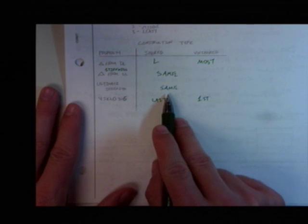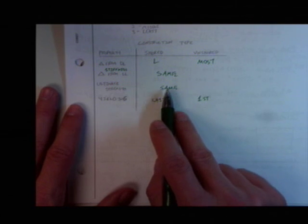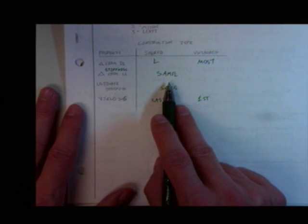Okay, just good to have all this in our heads, to understand what's going on. So if we're doing a design calc, does it make any difference if it's shored or unshored? No, it doesn't. At least for ultimate strength. How about for live load deflection? Does it make any difference? No. Doesn't make any difference at all.